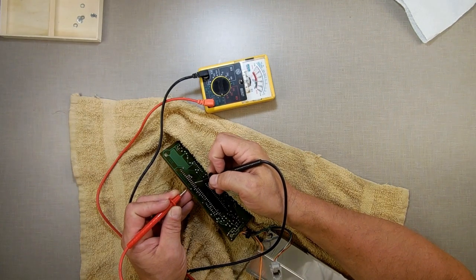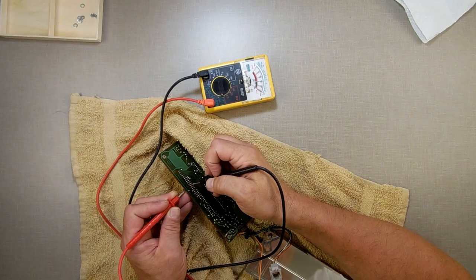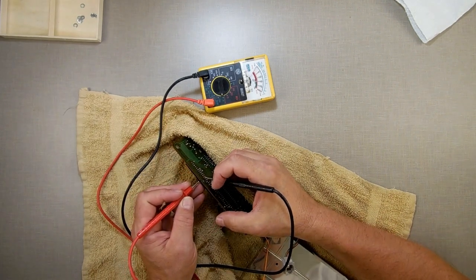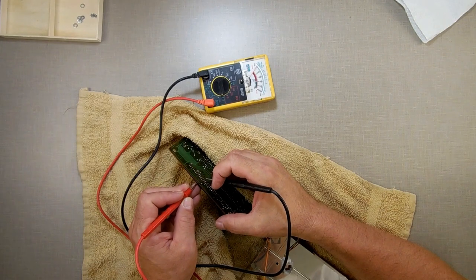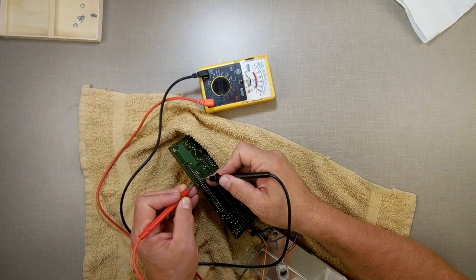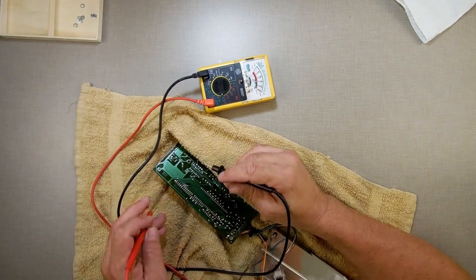So we've been there. It's good. We get there. It's good. All right, so we do know this connector is good. Well, let's just check something here. It shouldn't have any wobble. This should not wobble out of place. So I'm just going to go right here. Hold that there, and I'm moving the connector around, and no, there's no break in that trace. So that trace is good.